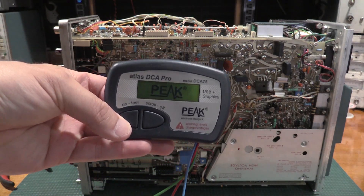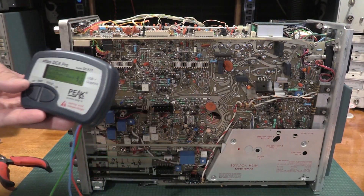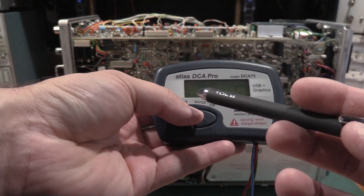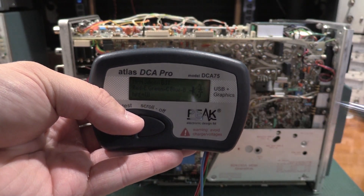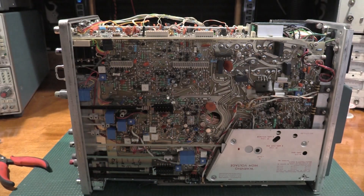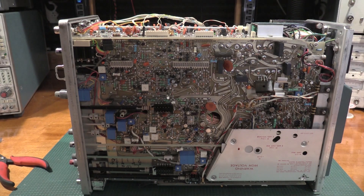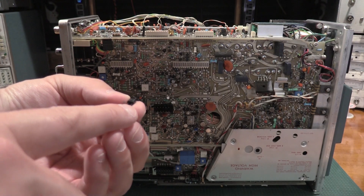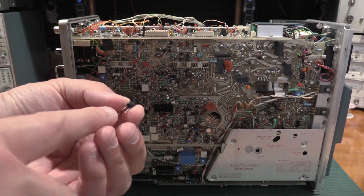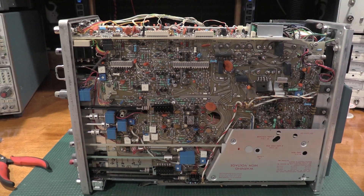If I turn them on, we'll test — and there's our problem indicated. This found an NPN transistor, which is correct, but it found a reverse protection diode in here, which is not correct. There's reverse leakage across the transistor — there's an extra diode in there that's not supposed to be. Now if you just do a transistor test on these, they'll test fine; I checked them on the meter and it tests good. But if you do a reverse bias collector or emitter to collector, it will show a diode drop. So I will fire up the curve tracer and see if I can show that.